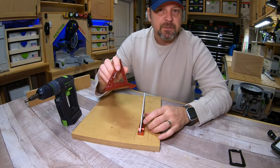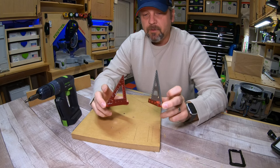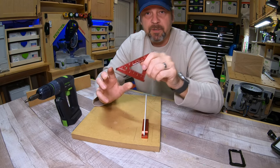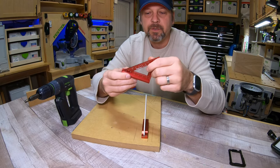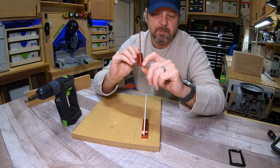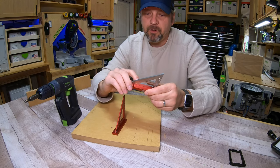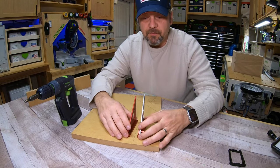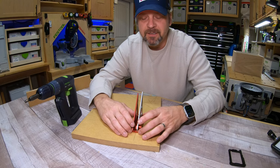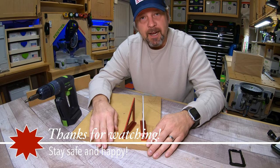Anyway, that's a quick overview of some of the features of these little delve squares. Here's the all-aluminum version I've had for a while - I use it very often - and then the new stainless steel version. They're both the exact same dimensions, but the stainless steel is a lot heavier. The aluminum version does not have the setup blocks feature built in - it is a quarter of an inch thick so you could use it as a gauge block, but it doesn't have all four of the setup block features the stainless steel version has. Hope you found that useful - thanks for watching and take care!